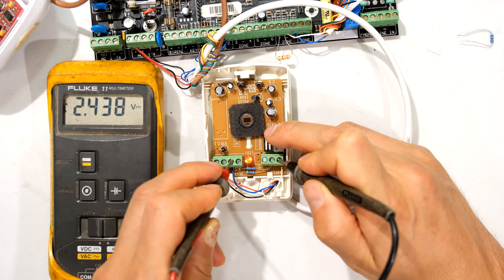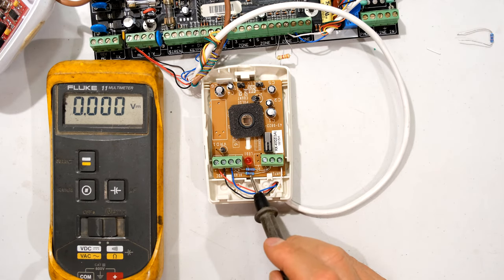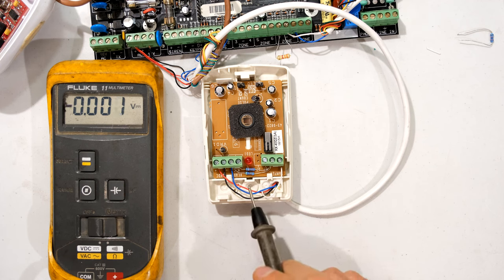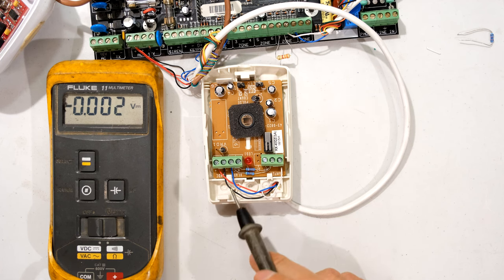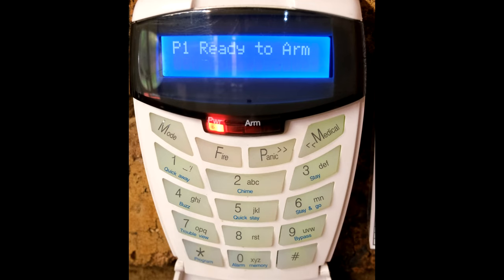Here's the difference: when I move in front of the sensor, the voltage does not go to 4.8 volts — it goes to an intermediate value, about 2.4 volts, somewhere between 2 volts and 4.8 volts. This varies for different alarms. In this case it's a 12k resistor and a 4k7 — they are not balanced. Some alarms use the same resistor twice, like two 5k6 resistors. The point is I'm getting a differing voltage, which means my zone is measuring correctly. You could also use your keypad nearby to check if each zone shows as active when connected.